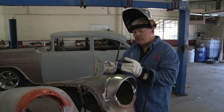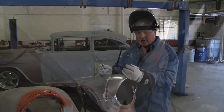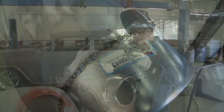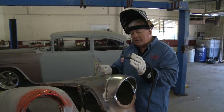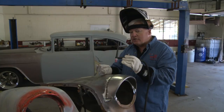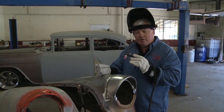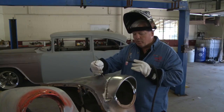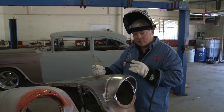We finished tacking this and if you notice there are tacks about every quarter of an inch — that prevents mismatch from happening while you're welding. John came through and did a final check for mismatch, doing cold working right after I finished each tack, which allows the metal to move a little bit easier. In our next segment we're going to show you how to weld this up in sequence. Thanks for watching — I'm Mr. TIG.